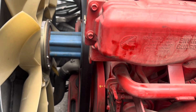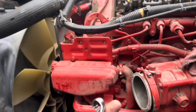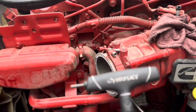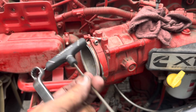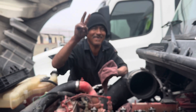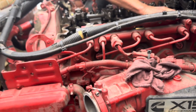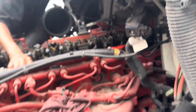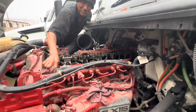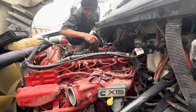If you guys have any questions feel free to hit me up. Hopefully this will help you guys out. These are the tools you're going to need: a 13mm from Snap-on for the half-inch adjustment on the engine brake, a number three Allen so you can adjust the top of the engine brake, and a 19 millimeter to break the locks loose and make your adjustments. Very simple — not terribly uncomfortable working on this International with the X15. Once we're done, we're going to cover it back up, put it all together, and this guy's ready to go home.